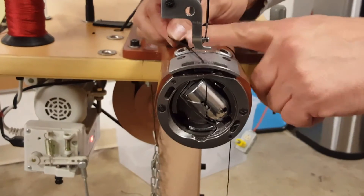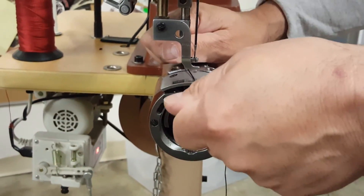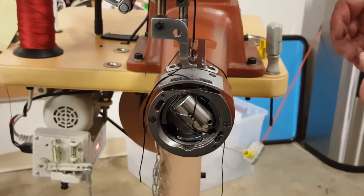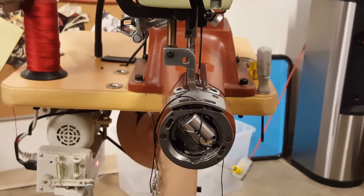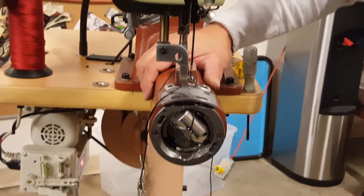This makes it really convenient so you can continue holding onto the workpiece with both hands, and you don't have to reach over to the hand wheel to cycle the machine. This is really a good feature for the King Cobra where it's so long that you can barely reach the hand wheel. It makes it so the small person can operate the large equipment, but it also saves fatigue on the day-to-day operation. I hope that clears up some of the mystery of the EPS system. Contact the Leather Machine Company. This is Al Bain for Leather saying have a good night, and please pay it forward.